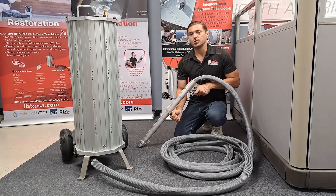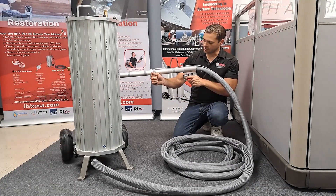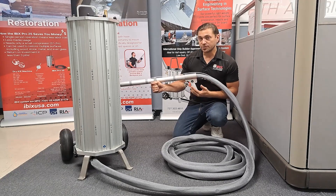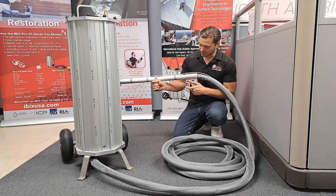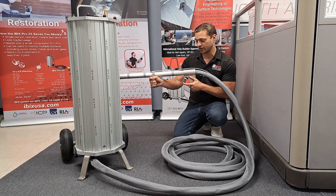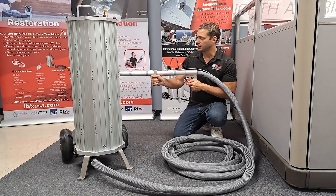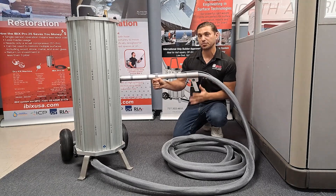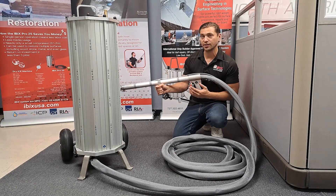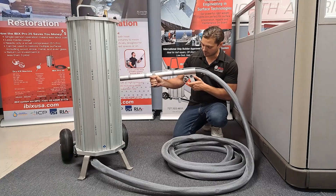With the Hi-Pro 60 you get the extended lance gun with the 15 millimeter nozzle. On the side of the gun is our dead man switch, or safety switch. When you first use the gun you will have to push in on that black button to use the trigger. Once you push it in, you can pull the trigger; as the trigger is pulled you can let off the black button and continue to blast. Once you release the trigger you'll have to repeat that process. The safety switch ensures you use the gun safely — you will not be able to pull the trigger until that black button is pushed in.